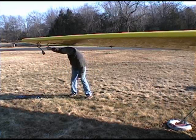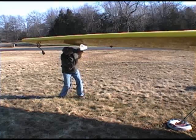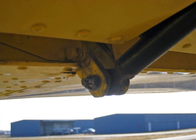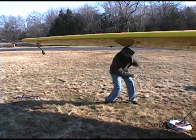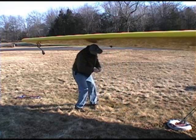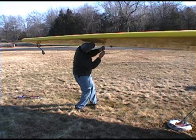Now let's look at the aileron. Under the aileron, there are six hinges that it moves on and a push rod. Looking at the push rod, we'll see a castellated nut and safety pin. There's a small observation door that we can open to look in and see the mechanism where the push rod comes through the wing from the back of the cockpit. Let's take a look to make sure it seems secure and the safety pins are in.